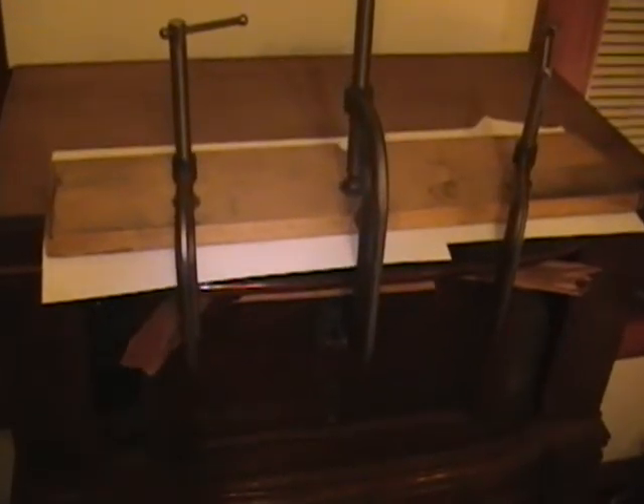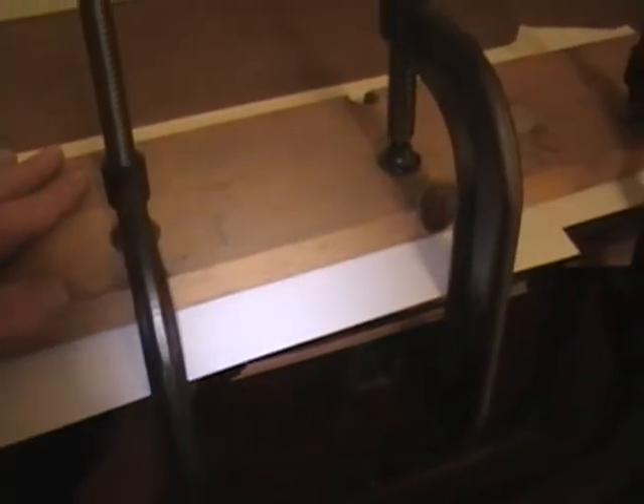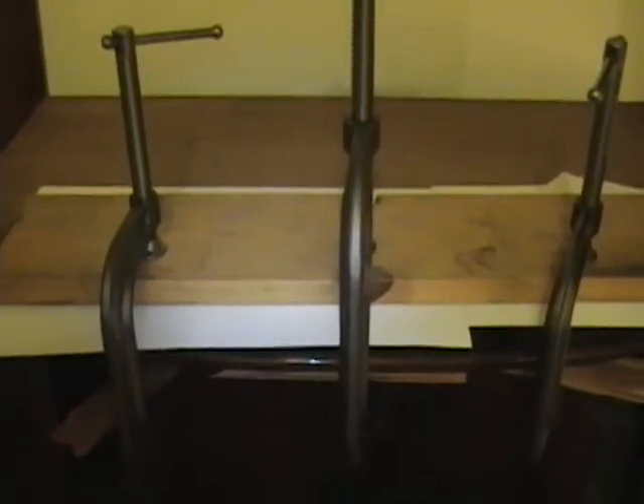Alright, I've got everything clamped down. I put a piece of paper between the pressure board — to distribute the pressure of the three clamps evenly across the piece of veneer — so the board wouldn't get glued down to the veneer. That's just a release paper. I also put some pieces of wood underneath with the bottom of the clamps so I don't crush that wood on the old radio. I cranked these down as hard as I could and I'm supposed to wait about two hours.